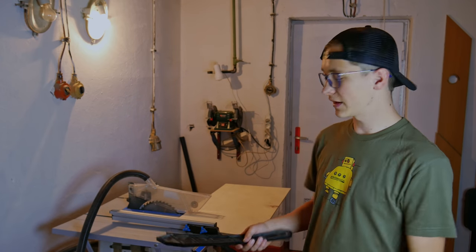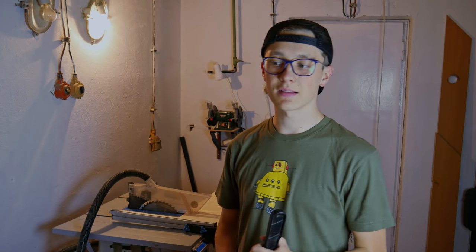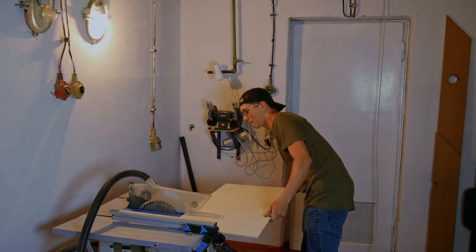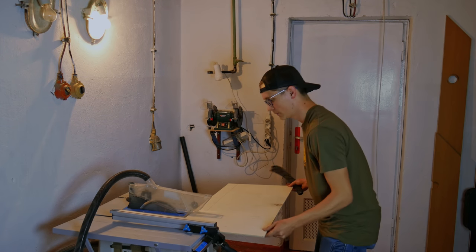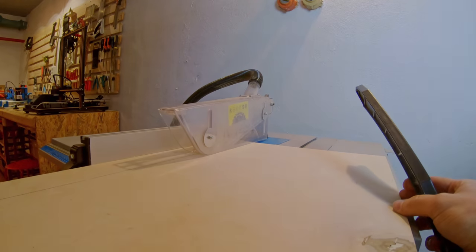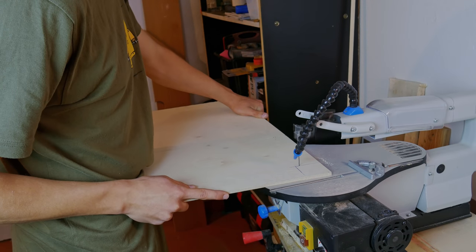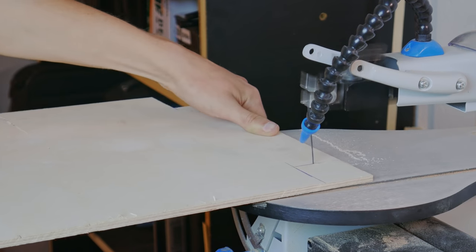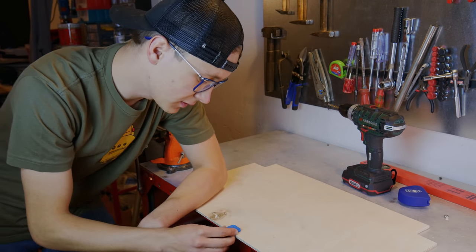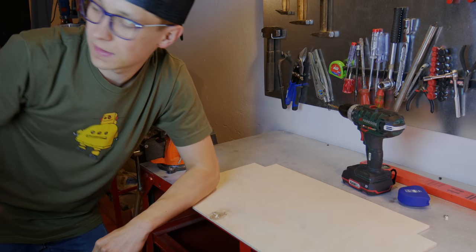For the table of the CNC I will use plywood again. In the first CNC I used 10mm thick plywood, and this time I will try 6mm — that way I will have 4mm more workspace on the z-axis. To cut the plywood you can use anything: a jigsaw, hand saw, but I will use a table saw because it's the easiest for me. For drilling holes in the plywood I designed another 3D printed tool, also available on my Thingiverse. You put it on the edge of the plywood and mark where the hole should be, giving a perfect distance from the edge to easily fix it to the CNC machine.